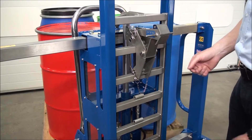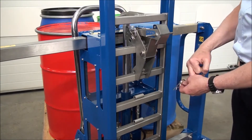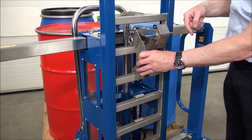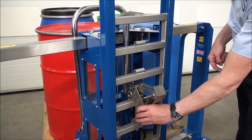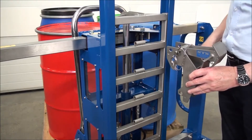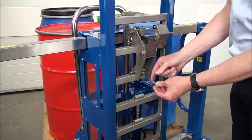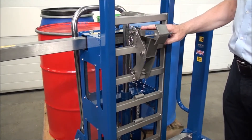We can also reposition the clamp height. If you've got a very short drum, we take the R-pin out of the bottom catch, take the pin out, and lift the assembly off. This is the section where it plugs into the unit — it just sits on top. We can put it in a much lower position to pick up very small drums. The standard position for 200-litre drums is this top rung. To refit: put it in, hooks over, take the securing pin, put it in the bottom, and put the R-pin back. It's now set in the Mauser setting at the correct height, ready to go.